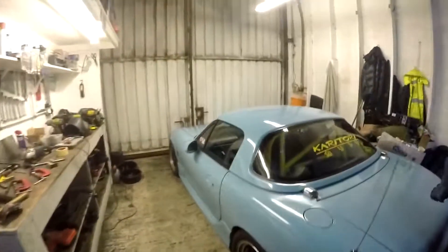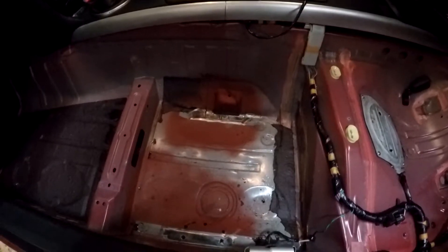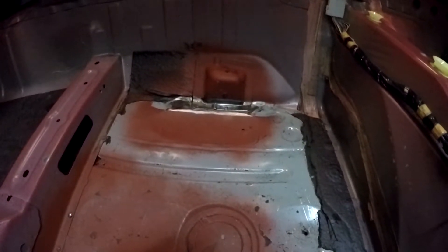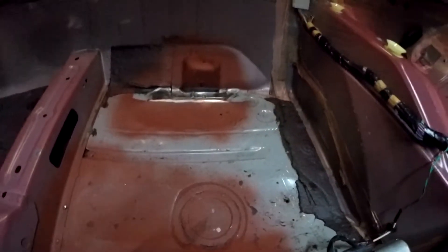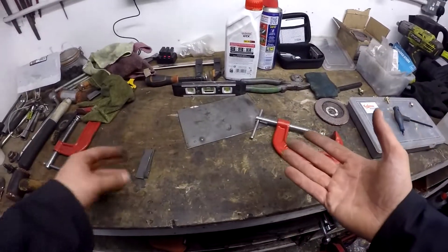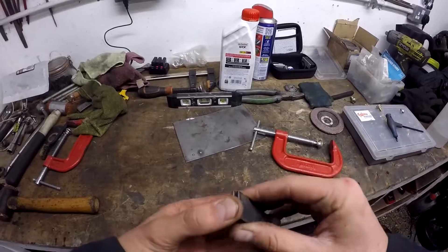I'm back tomorrow and we're going to finish it off, get the rest of it tacked in. Still got to make sure that this goes in level with all the seats. We're back — day number three. This is going to be the day it goes in, hopefully. What we left off with, as you know, is we had it all cleaned up and ready. We sprayed it and it was ready for weld — masked up the areas I'm going to weld and sprayed over the other bare metal. All I've done now is taken off the tape, given it a clean with panel wipe, and given it a brush to get rid of all the crumbly stuff, just so it doesn't sit far or melt. So I was just talking to everybody, walking around doing my stuff, explaining things, and I didn't even hit record.